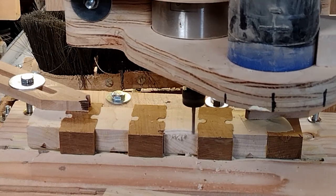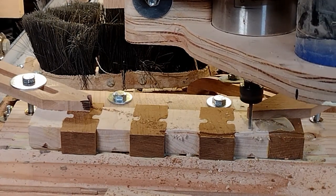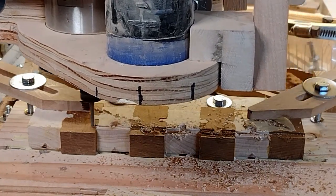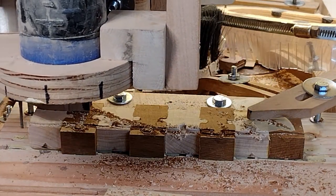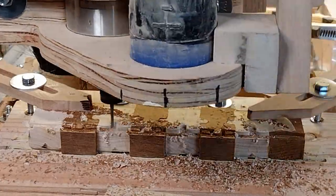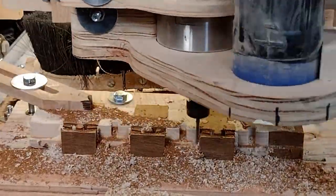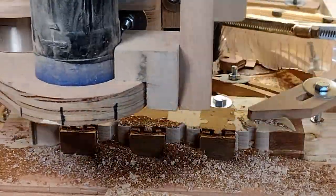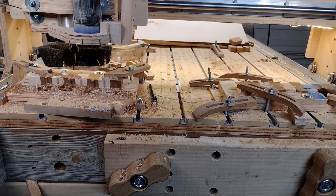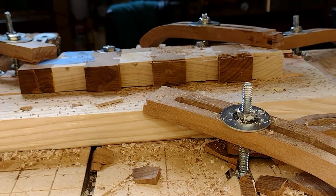This process is actually very time consuming. Before I told you it took two minutes for each puzzle piece when cutting the original blanks, and now it's taking eight minutes for this process to do one side. So I've got to come every eight minutes, change out that piece into the jig, and start it again — very time consuming. But I came up with a trick to make it twice as efficient, so I've got to come out every 16 minutes instead of eight. I combined the toolpath for the inside cut on one jig and the outside cut for the other jig into one long toolpath. Note how the machine pops up, moves over to the other jig, and starts cutting — all done automatically in the code of the toolpaths.